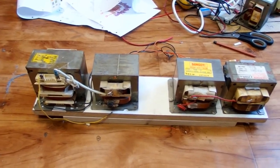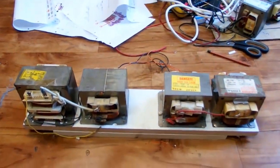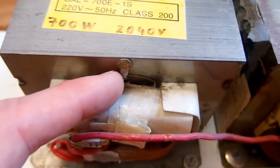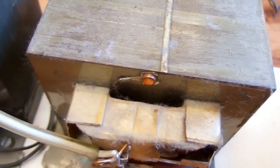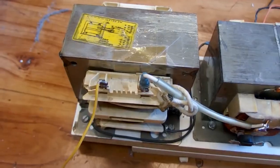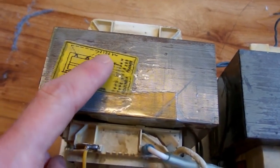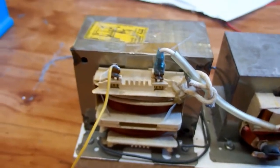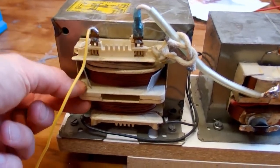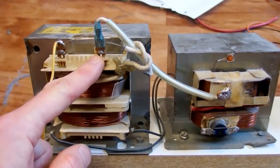This is my entire power supply with four microwave oven transformers with secondaries in series. One special transformer in the setup is an unusual microwave oven transformer made by Moulinex France — one of the best you can get. It has a plastic bobbin with windings on massive plastic insulation instead of just paper, making it the best choice for disconnecting the lower secondary end and connecting it in series with another secondary. The secondary is actually not permanently connected to the core — it has two individual terminals.